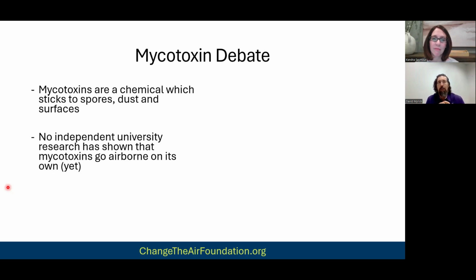And so, to my knowledge at least, no independent university research has shown that mycotoxins go airborne on their own. Now, I will agree with the people who say they're attached to spores and dust, and that goes airborne. Yeah, I agree, but I'm trying to remove that particle. I'm not trying to remove mycotoxins that are floating in the air. And so again, I'm very skeptical when people are buying fogging and what's the other one? Candles, and they're like, it's going to remove mycotoxins. And in my head, I'm thinking, I have oceanfront property in Arizona to sell you. I'm sorry, they got sold a bag of goods.